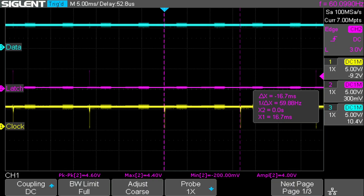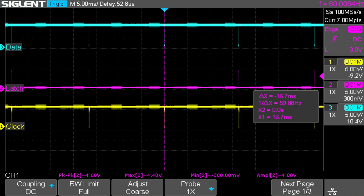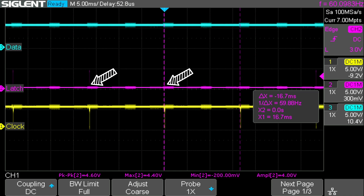As we've seen, the frequency of it varies slightly from pulse to pulse. But we also know that this is sent every single frame. So if we can monitor this signal and keep track of how many times we've received it, we'll know exactly where we are in the game, and the slight frequency variances don't matter at that point. And if we know exactly where we are in the game, we should be able to change the controller state at exactly the right time, which should give us the ability to say jump for exactly one frame, and so much more.